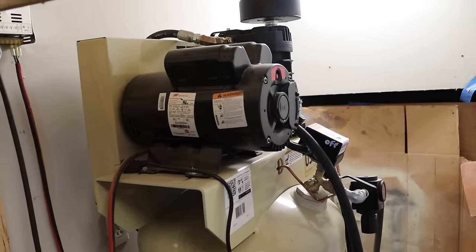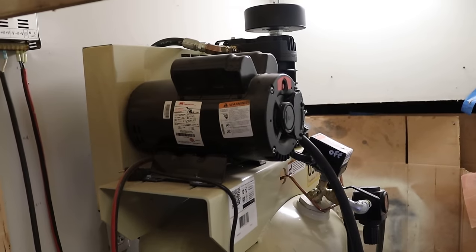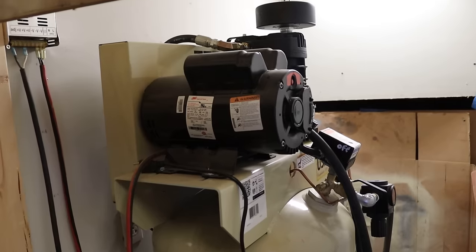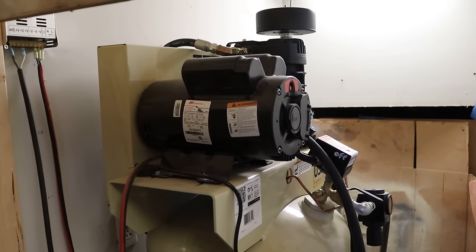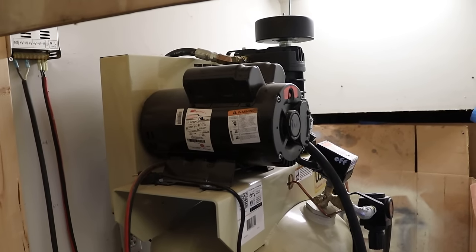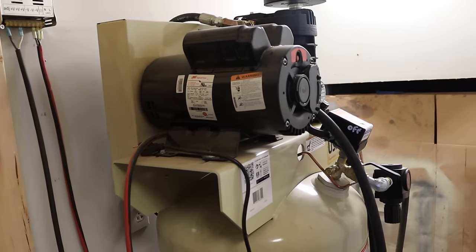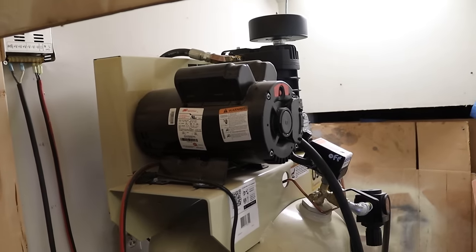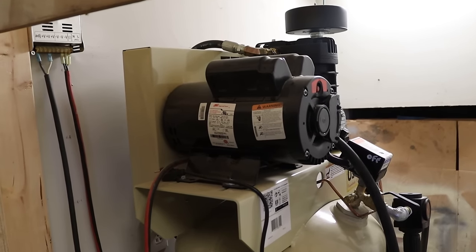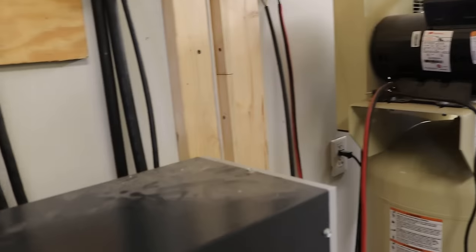You need dry air. How do you get dry air? Well, if you live in the southwest desert, then your air is already pretty dry. But even in that case, when you compress it, you are consolidating what moisture is in the air. And at 90 PSI, whatever moisture was in the air, if it's very low humidity at atmospheric pressure, at 90 PSI it's got 5 times the amount of moisture that it did at normal atmospheric pressure. So even compressed air in the desert southwest warrants some form of condenser unit or air dryer. So how do you get dry air?